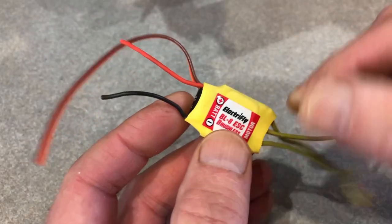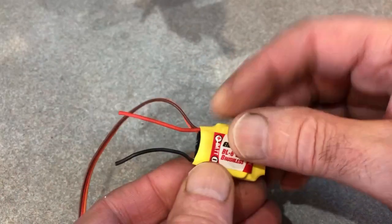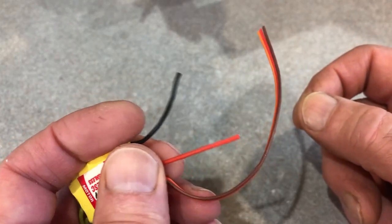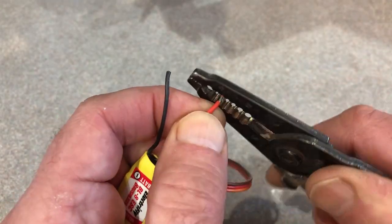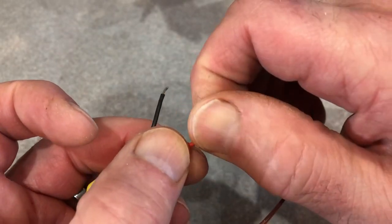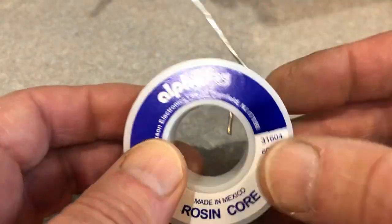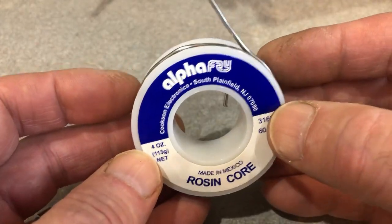This is a little ESC speed control for a model airplane I had, and this is just out of one of my junk boxes — I'll use it in a future project. It got taken out of some other project long ago and got the plugs cut off of it, so I need to solder on a little wire extension and put a plug on there. The first step is getting some insulation off the wire; I do that with some little wire strippers. I always like to wind up the braids of the wire a little bit so they don't just flail around and stick out when you go to solder it. For soldering these wires, I'm going to use a 1/16-inch diameter rosin core solder — it's the 60-40 blend, probably the most common type of solder for soldering electrical connections.